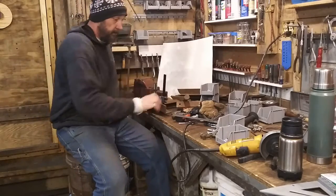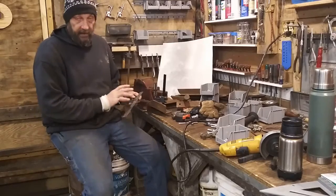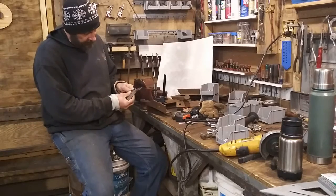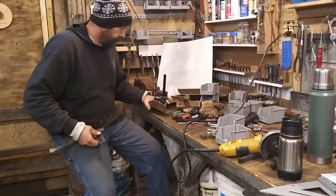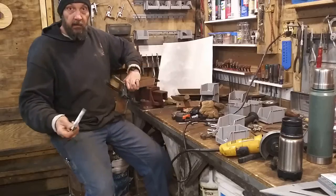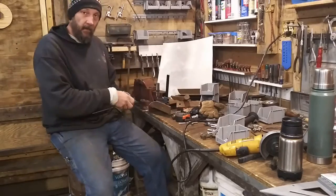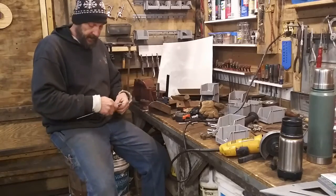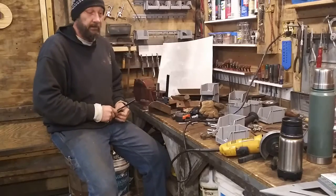And if you guys don't know what these little slide combination squares are, they're beautiful. They got your millimeters and fractions. And really, if you want an inch in on something, you just set it there to your inch mark. You take your metal, you scribe your line, pow! Inch, and then you hit that with a center punch, and you drill it. And that way you know that all your measurements, every time that you measure for the same piece, is going to be the same because of the combination square. Nice little tools. You can buy them cheap, or you can buy them expensive.